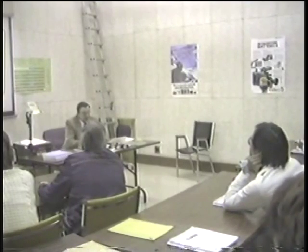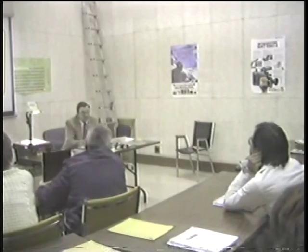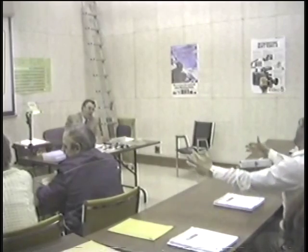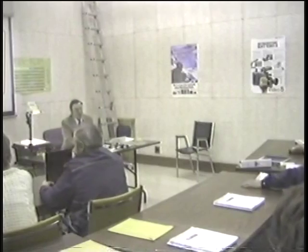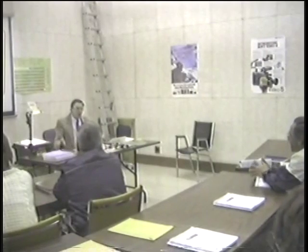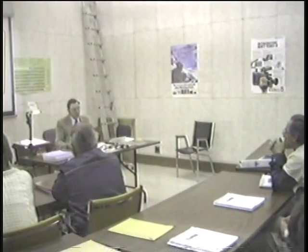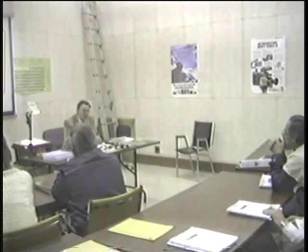So far I found it 7200 for that Beta 1 recording. Well, Beta 1, eh? 7200, I mean. The faster the tape goes, the better the high-frequency response is going to be. Beta 1 is beautiful. We could have made a really super Beta machine just by going back to Beta 1. But they're reserved for industrial use. Restricted? Well, no, it's the tape time. People want the length of time on the tape.